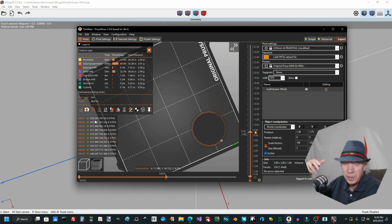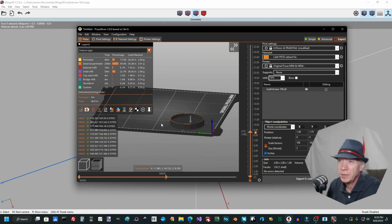And it pulls in the plastic, it pushes out the plastic, it extrudes and pulls it back in. And you set the temperature for your plastic. If your first layer does not stick to the bed, it's time to quit, because it's like building a house on the sand. The whole thing's just going to fall over, and this is hot plastic, and the first part has to work.